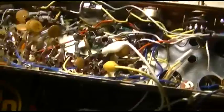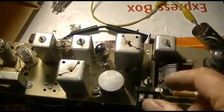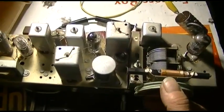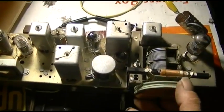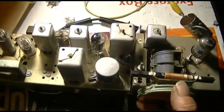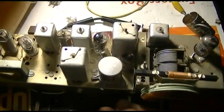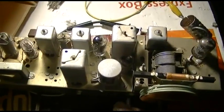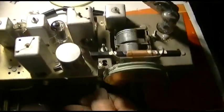Well, changing the tube made an immense difference. It made a 40 dB difference. And it tightened it up, but I still don't think we have any FM reception. Well, I turned it over and moved that tube around, and it seems to... Very distorted, and the channel, the thing is very narrow.